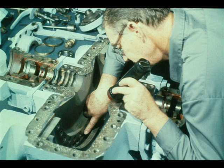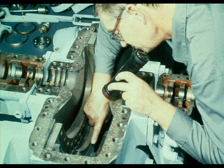Next, inspect the nozzle ring in the turbine case for steam erosion and determine whether or not replacement will be necessary. The nozzle ring is not normally removed from the case unless it has to be replaced. The stationary reversing buckets in the turbine case should also be inspected for damage from steam erosion.